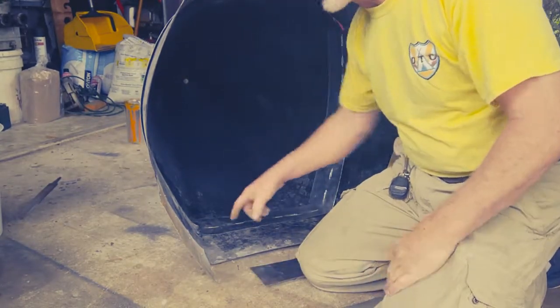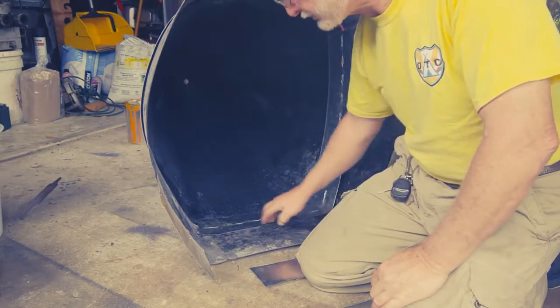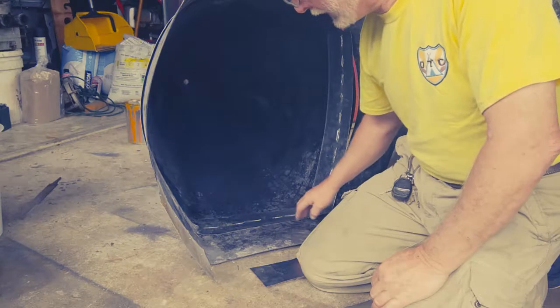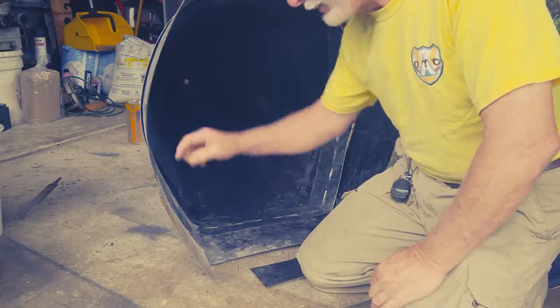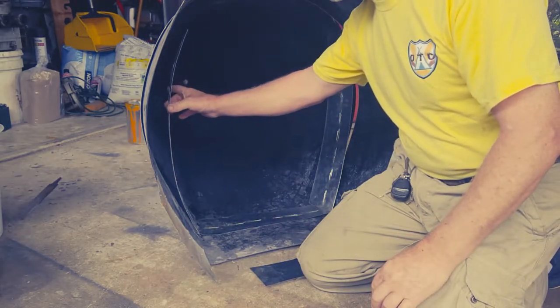The idea of these slotted holes is we're going to work with fiberglass. We're going to coat this with fiberglass resin, let it come up through these holes, and put cloth over it when we're done, so it'll bond the two together through these holes. We'll probably widen the holes just a little bit more. These will act as the retainers to go onto the side.